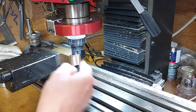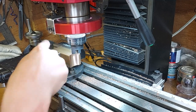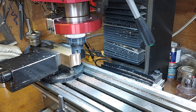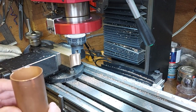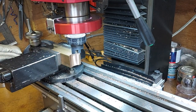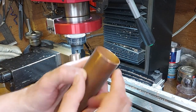I'm fly cutting the arc on the underside of what is going to be the main block that holds the cylinder on my traction engine. This arc has got to fit onto a piece of one and three quarter inch diameter copper tube — so it's going to fit on there, that's one and three quarter inch in diameter.